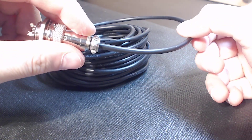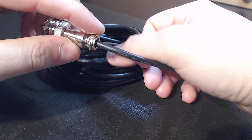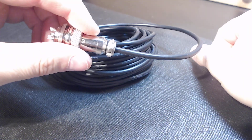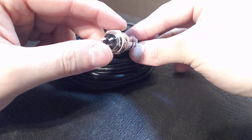You can see here we've got our stress relief. This wire is actually too small for the stress relief, so I installed a rubber grommet — that grommet takes up the space, does not allow any chafing on the wire, and you've got a professional connection. The only thing on your side that you'll have to do is solder in your panel connector leads.